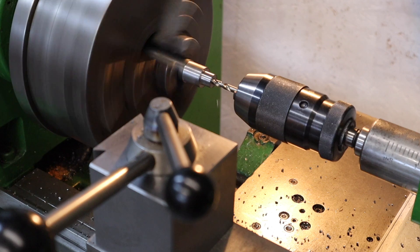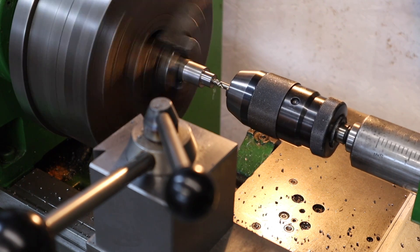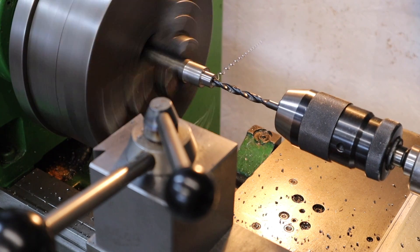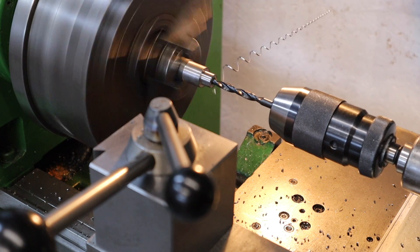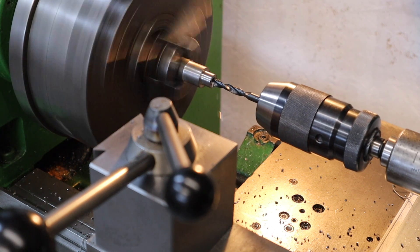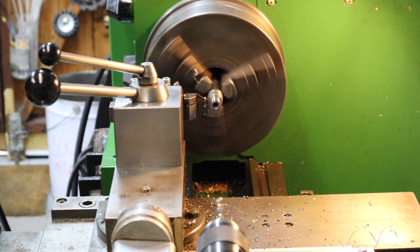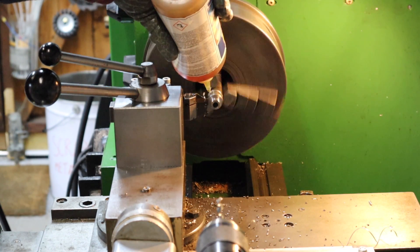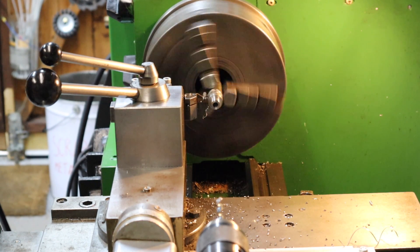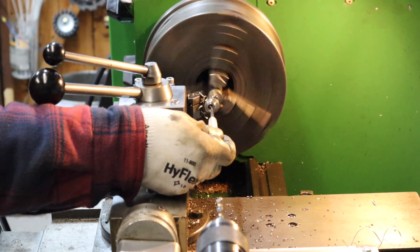For any insert over 12mm I decided to drill a through hole so I can bolt the insert down into the taper tooling — I've got that drilled and tapped hole in the taper, so why not use it. The final thing left to do on the inserts was to part them off to an appropriate length. In my case that was an overall length of 21mm, which accounts for the depth of the hole in the taper plus a little bit sticking up to locate the part. And just like that, we have an insert.